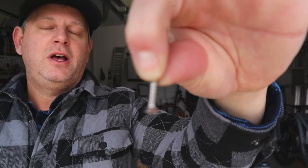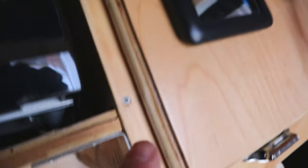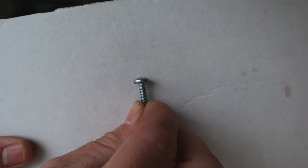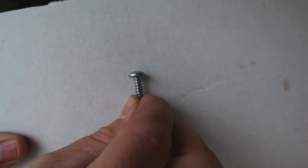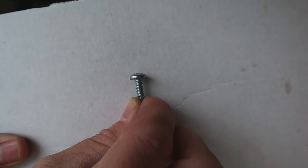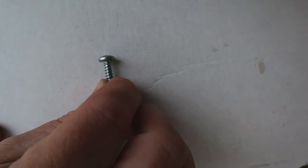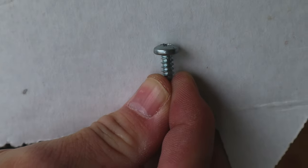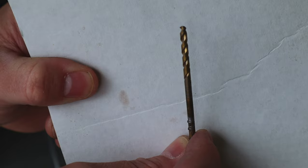For example, your walls or ceilings to your furring strips, your plywood floor to furring strips, or just in general cabinet making. Your second fastener is the sheet metal screw. Notice on the sheet metal screw the threads go all the way to the head of the screw, and the thread per inch is finer. These types of screws are used to affix sheet metal and can also be used to attach things to sheet metal. With a sheet metal screw, you're going to want to pre-drill the surface first, using a multi-purpose drill bit.